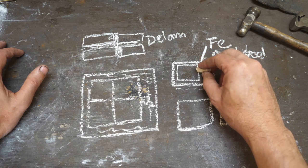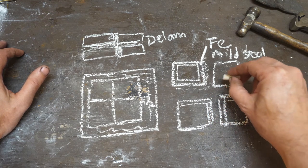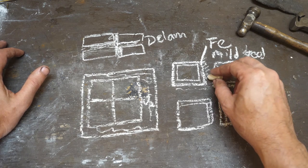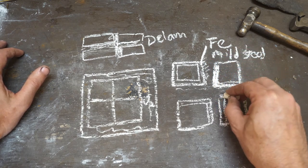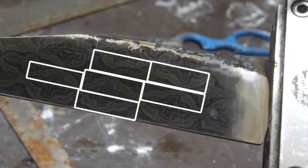So if you don't grind all of this off, you have a tiny layer of it on all your welding surfaces. Even though you've ground off the black oxide, there's still this layer of decarb steel and that etches bright. When you put two sides together, even though it's a very thin line, it shows up.